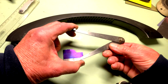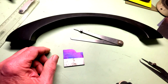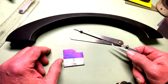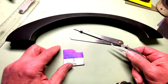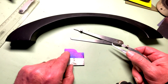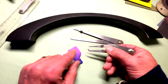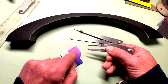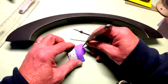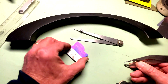Well, what are these used for? It's got a nice friction fit here — just right. It doesn't move unless you give it some good firm pressure. I've only used these a few times in my life, but I'm pretty sure I know what they're used for. What I've used them for in the past is if I needed to scribe a line parallel to a surface. Let's say I wanted a quarter-inch offset from this profile — I would set my hermaphrodite calipers to a quarter-inch, and then I could simply just follow this edge and scribe a line. You see that?